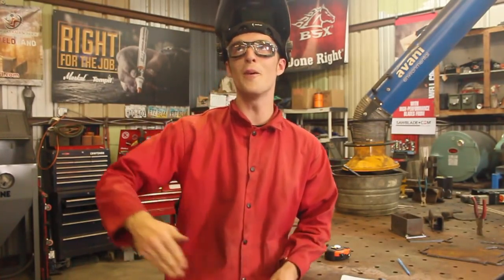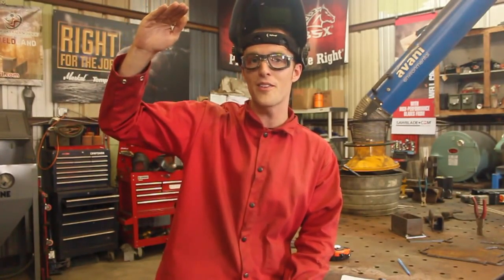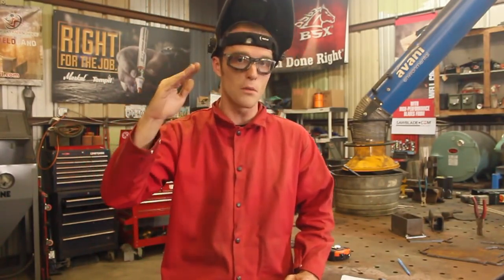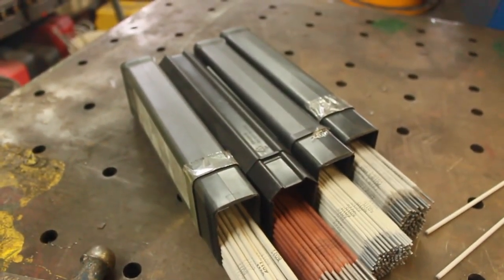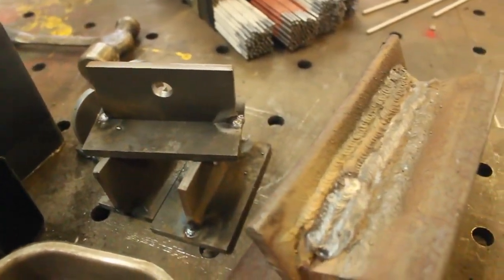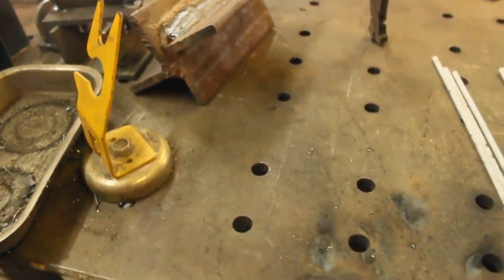But the great thing is, if I'm only welding at 150 amps for part of the pulse cycle and then we go down to say 70-75 amps and then back up again multiple times a second, I end up with a nice, fairly smooth, very controlled arc and I basically get many if not all the advantages of welding at a higher amperage without many or any of the disadvantages.